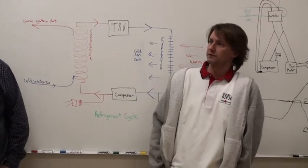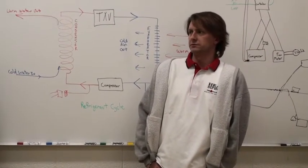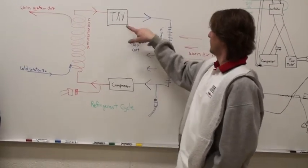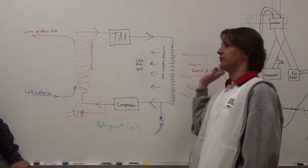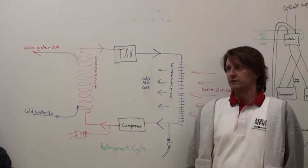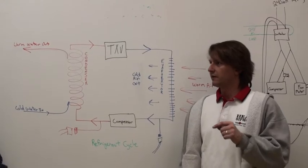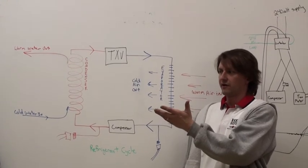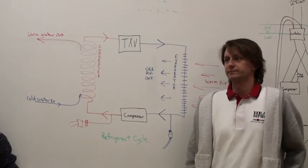So the symptom of the run capacitor is: the compressor is not coming on, or it's running but blowing warm air. If the compressor is not running, that will be warm air — the only way it's cold is if the compressor is moving cold refrigerant to you. You're just moving air. When you put a new run capacitor in there, you're probably going to hear the compressor noise immediately, and five to ten seconds later — very quickly — you'll feel that air go cold.